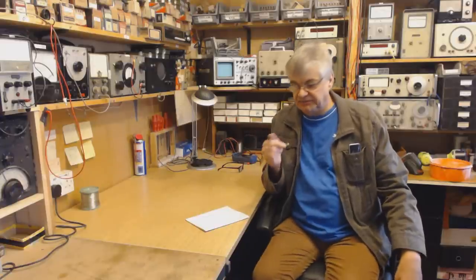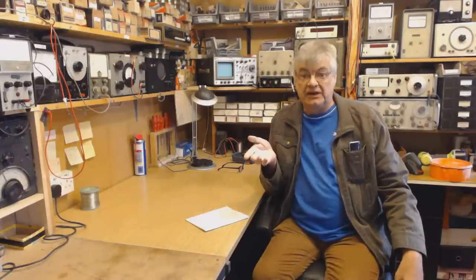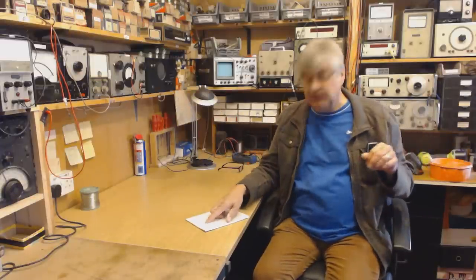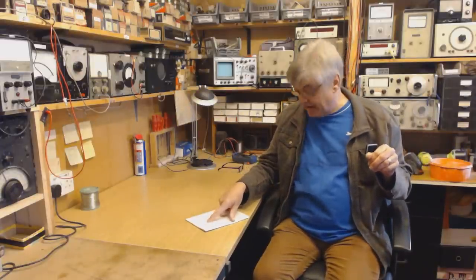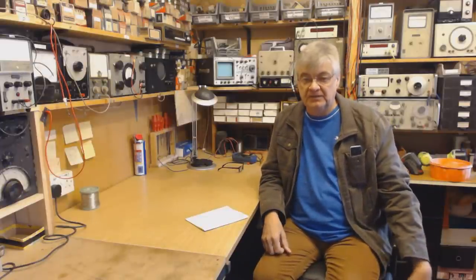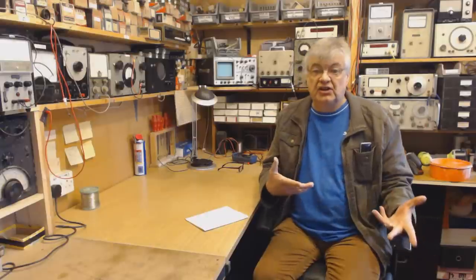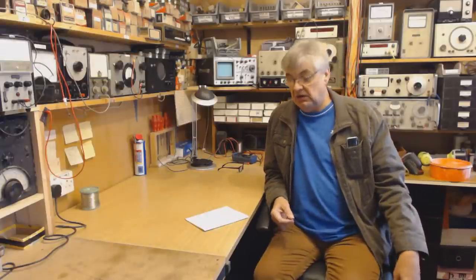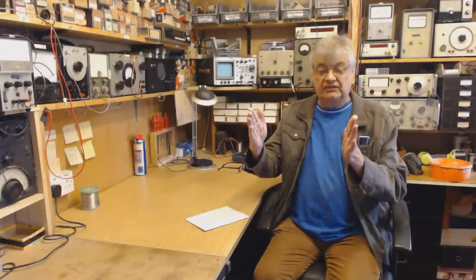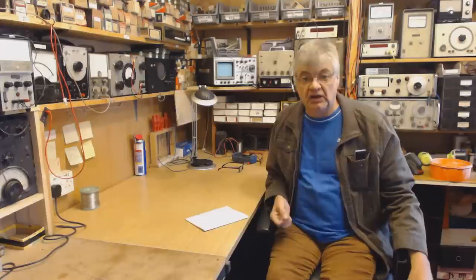What's the way round that? The best way: you've got your same dipole, you've worked it out for your 40 meter amateur band, you've put up your 66 feet — feed it with 300 ohm ribbon. I like the balanced line, the balance feeder. I use 300 ohm because it's neat. You can use 450 ohm, 600 ohm, whatever you like. Make your own wide-spaced stuff if you want. I like the 300 ohm ladder line — it's neat, it works well.